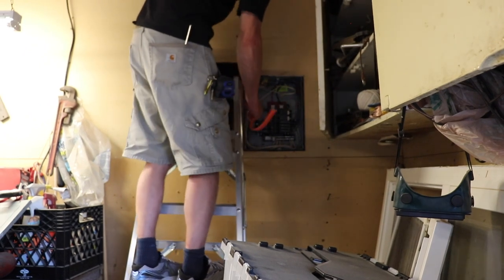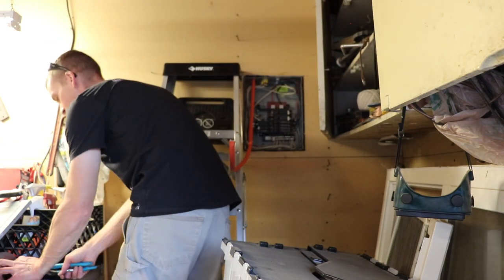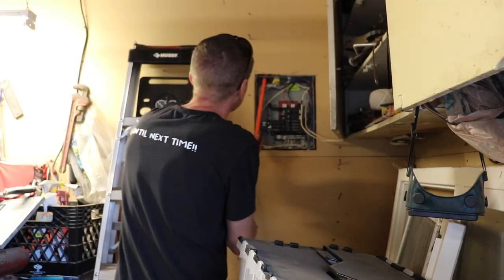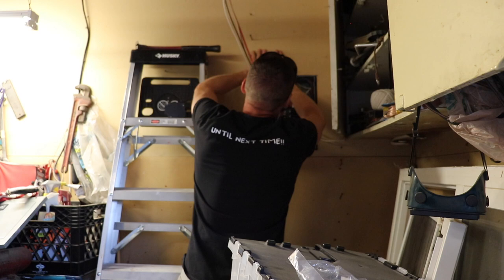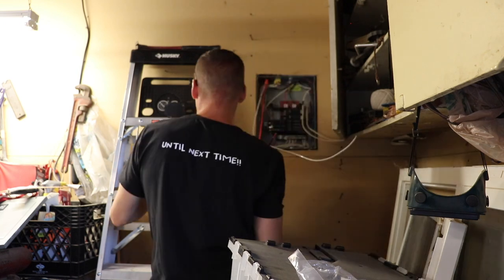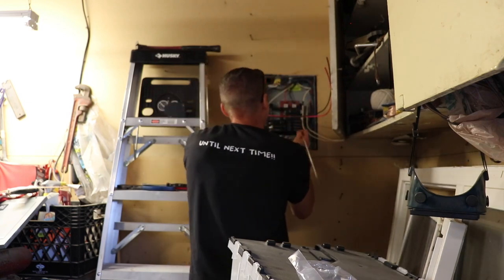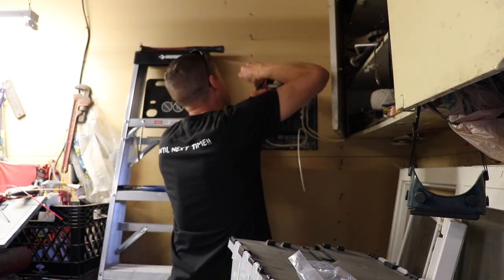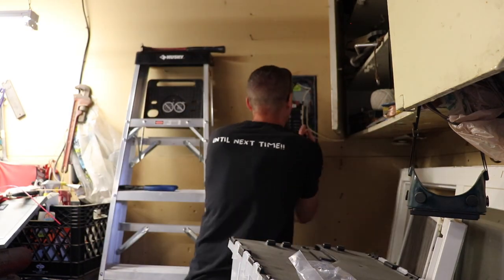I ran the electrical wire from the unit through the attic to the electrical panel, and now it's time to tie in. There wasn't any extra space open in this electrical panel, but there was a 230 volt welder that wasn't being used. So we removed the 40 amp breaker and I installed a 30 amp double pole breaker. I hook up my red wire to one pole on the breaker, the black wire to the other pole, and then I hook up my common and my ground to the termination bars on the panel.